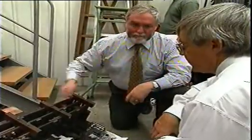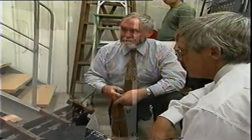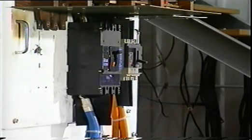Certainly the downtime with the circuit breaker, and in particular the second circuit breaker, would have meant that a fair bit of switchboard rebuild would have had to have occurred, which wouldn't have happened with the fuse. But I think we should mention that we were interrupting a full level fault in this case. MCCBs can present a physical danger to operators and building owners. Specifiers and switchboard manufacturers need to consider this when selecting and approving circuit protection systems.